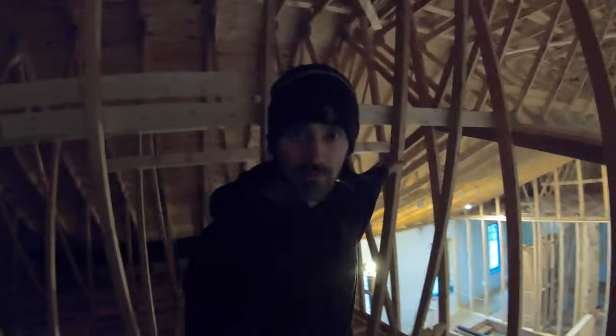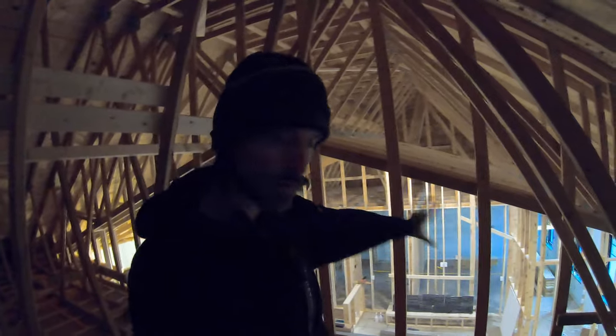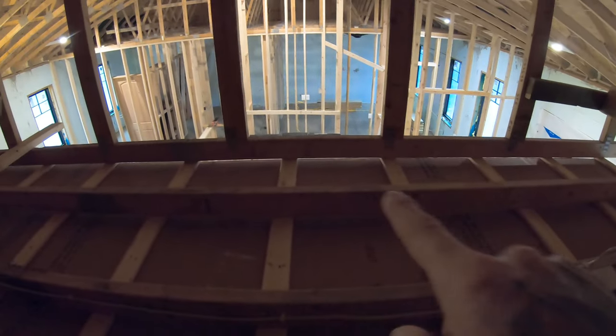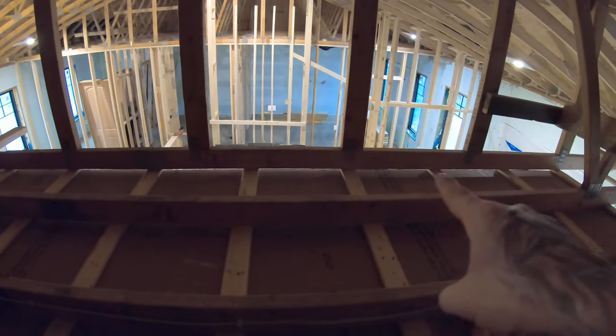The next thing that we need to figure out, probably in another video, I'm probably gonna wrap this one up here, but in another video, we need to start putting drywall up against this internal gable wall right here where these two bys are turned sideways. Obviously, you can see we're gonna have a gap right underneath of there. So all the light that's coming in there, even though the drywall is gonna go down and meet in an L-shaped corner and we'll mud that, I'm still probably gonna wanna put beads of spray foam down in there.